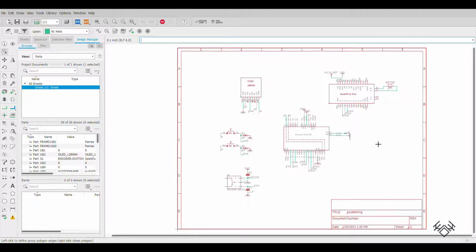I chose the components I did because I am familiar with the Arduino Uno, and all of the other components work well with it. The OLED panel I chose because it's a high contrast device and I only needed a 2-color display for the clock, making the monochrome 128x64 OLED panel an obvious choice for me, especially since I already own one.